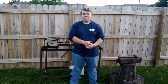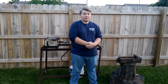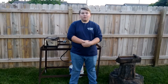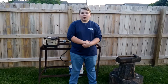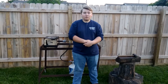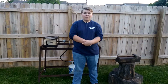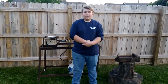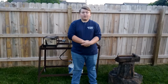And so some of the things I will be buying from the grant is a belt sander, which is a 2x72 or 2x48 belt sander, which the belt is wide enough to get good grind lines on, but is also long enough that when you use it, the belt won't wear out after 5 minutes of use due to the adhesive heating up so much and all the sandpaper falling apart.